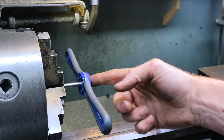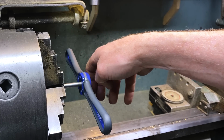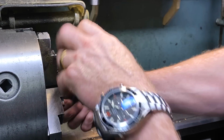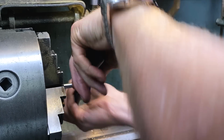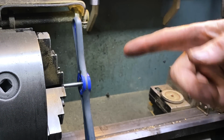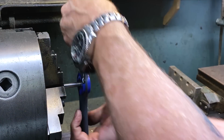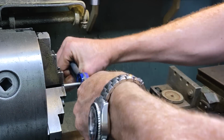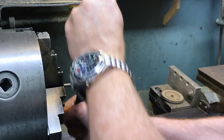That sound you hear each time I go forward is the sound of me cutting curls of metal out of the side, and then I'm breaking those curls off. So you hear me cut, break, cut, break. Every tapping guide I've ever read said when you're tapping, you should tap a full revolution and then back a half. I've always found that you should not do a full revolution. I've snapped a lot of taps trying that. Really, on this one, I'm going about an eighth of a turn and each time coming back just to make sure I've got what I need.